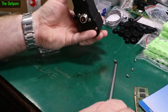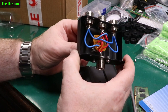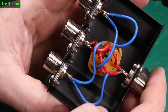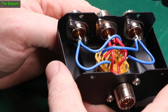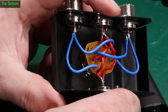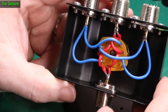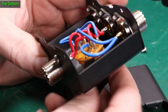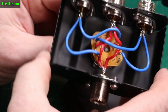There's an excessive amount of screws to hold the back cover on. These aren't a bit cheap either - you could probably make one yourself for much less money, but I wanted to buy a properly made commercial one. It's a standard rotary switch inside. It doesn't really look like it's been balanced or matched in any way - it's just a double pole, three position switch. You've got the signal splitting off and going through both poles in parallel, which allows for any contact issues and shares the current across it. Anyway, that's what's inside these OPEC CX-5s.